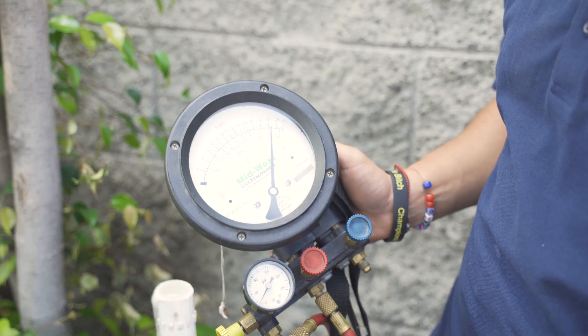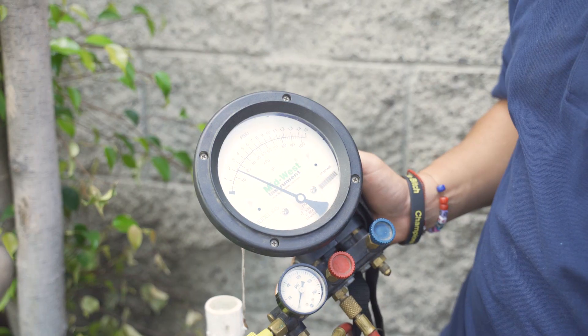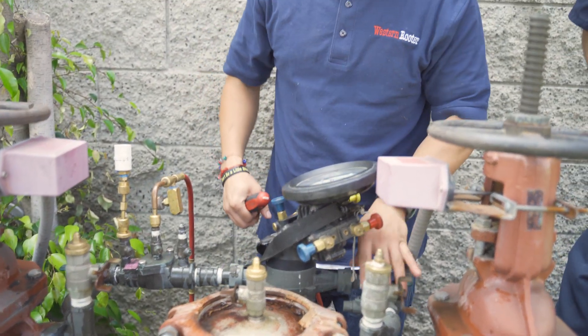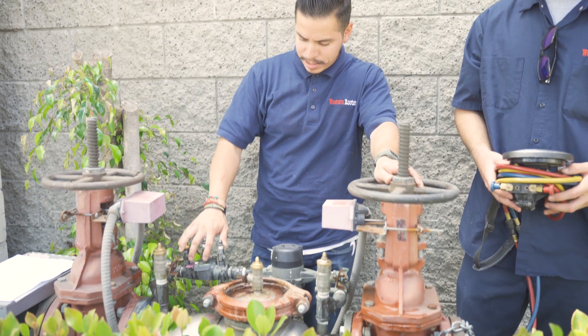This system services their fire sprinklers, so after years of this water sitting there it gets very contaminated and dirty due to bacteria growing over the years. What happens is this backflow protects the dirty water from going into the domestic water. So there are two devices, two check valves in each of these assemblies.